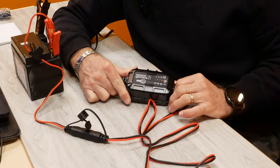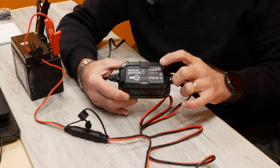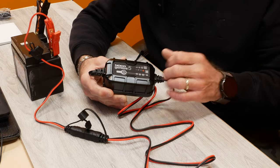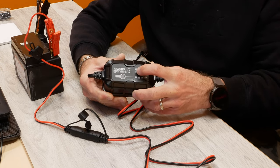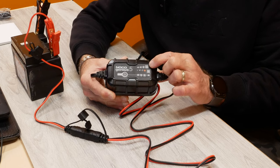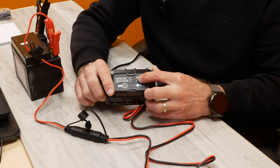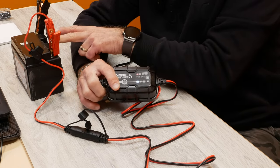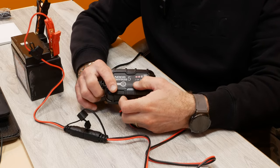Positive, negative — when it first boots up it goes into standby mode and shows you it has power. Going over the battery indicator LEDs: at the top you have a progress bar showing how far the battery is charged, and it goes in 25% increments. Once the battery is fully charged it will light up green. I'll go into 12V mode charging — it's showing it's going through cycles and already lighting up the second indicator because this battery is fully charged. I charged it beforehand, so it will eventually go green.